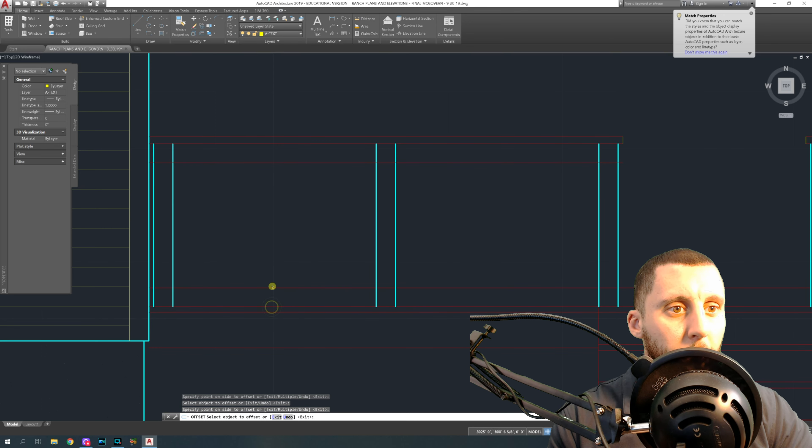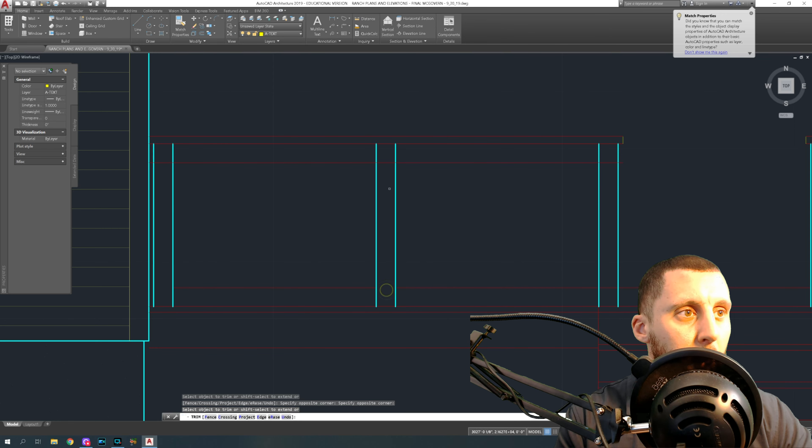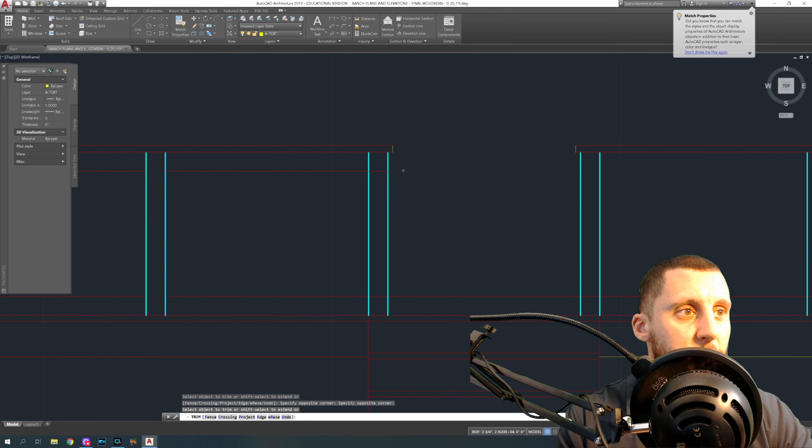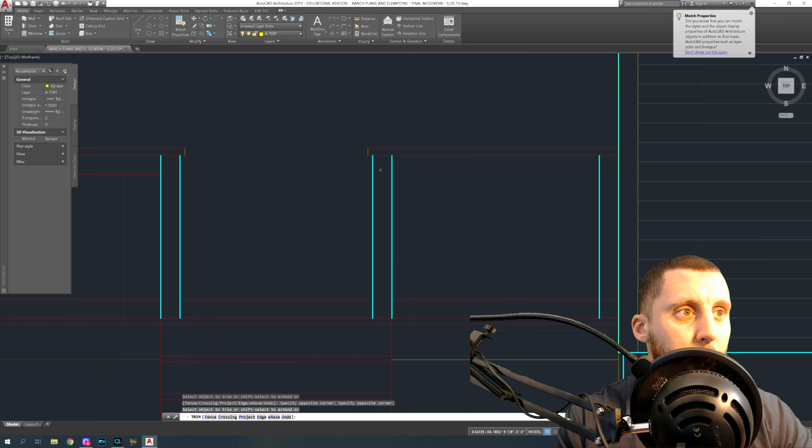Offset 4 inches — there and there. The gap at the bottom of the railing can't be bigger than 4 inches; that's a safety requirement so that children can't slide underneath. That's also the same reason the railing has to be at least 3 feet high — so a maximum of 4 inches at the bottom. Off of that line, trim that and that, trim in here and in there. You just don't want anything on top of the posts — the posts are the main structure.